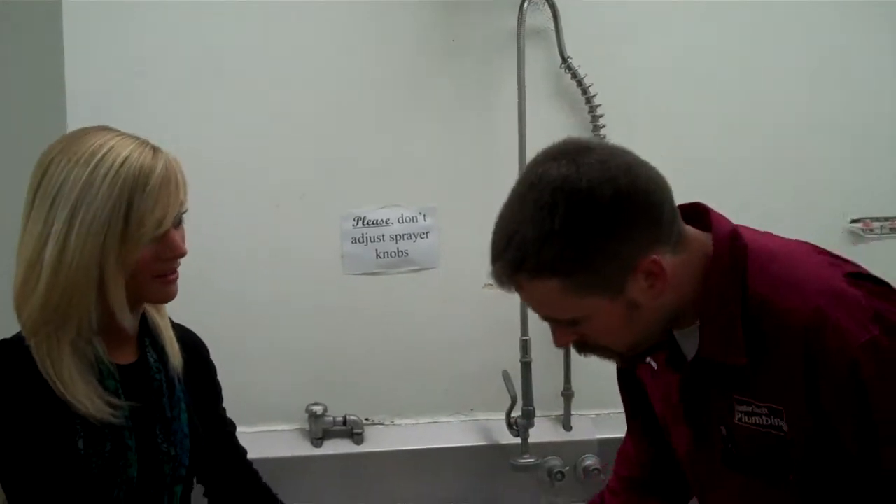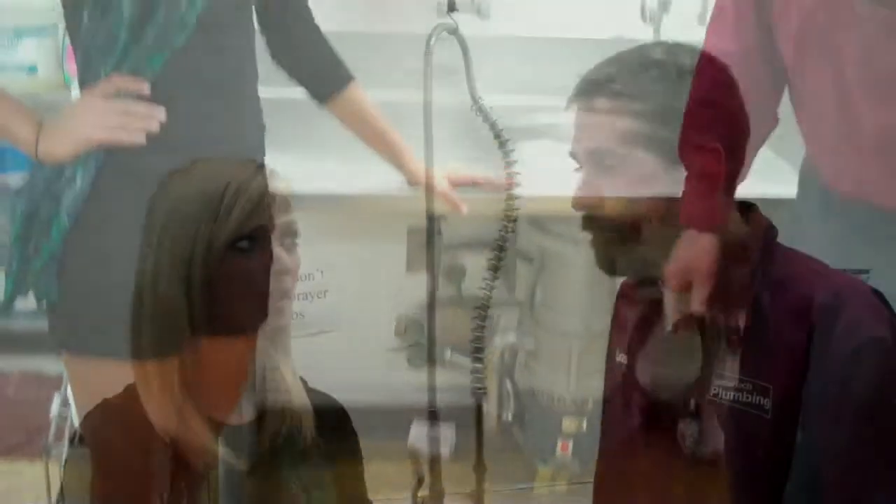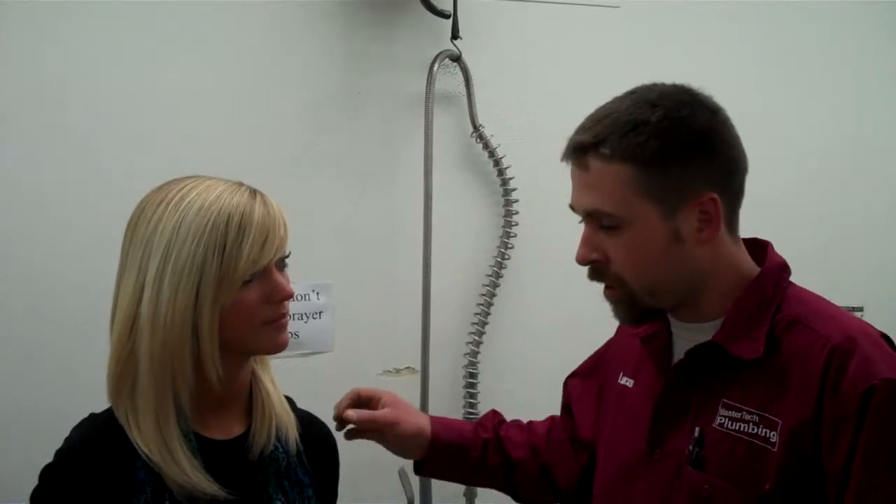So where are you going to be installing the drain strainer? Right underneath there, right next to the garbage disposal. So we're not actually replacing the garbage disposal? No. The garbage disposal is working fine. What we're after is catching the solids after it grinds, using the drain strainer to catch those solids at the solid separator before it goes into the drain lines.